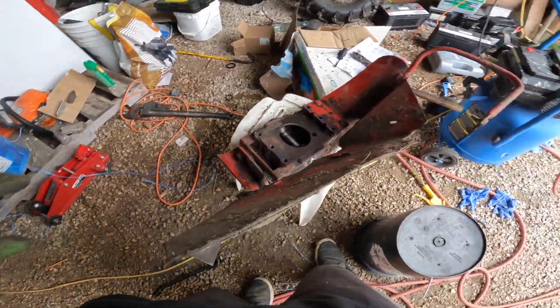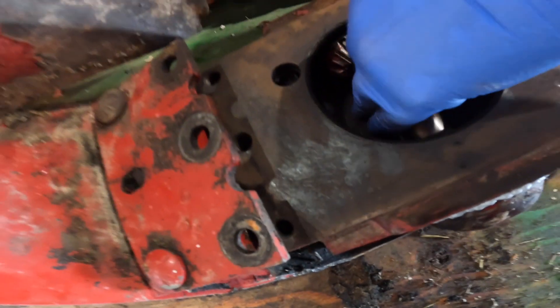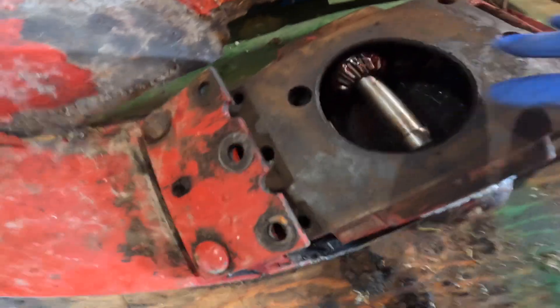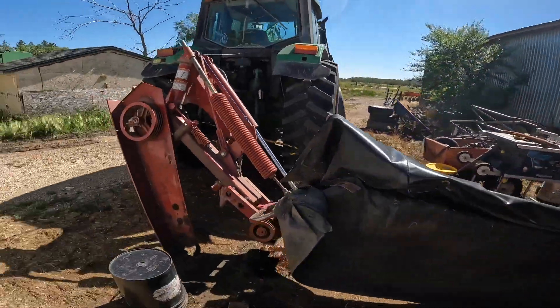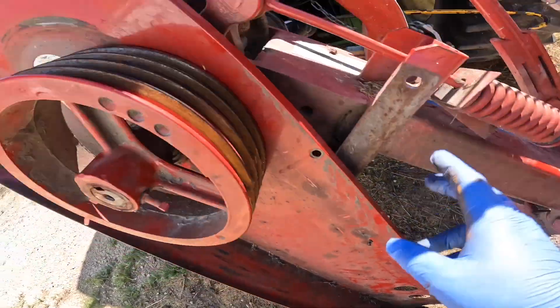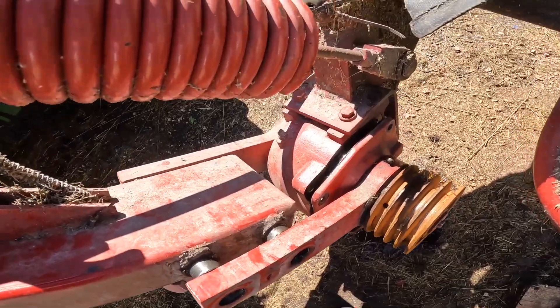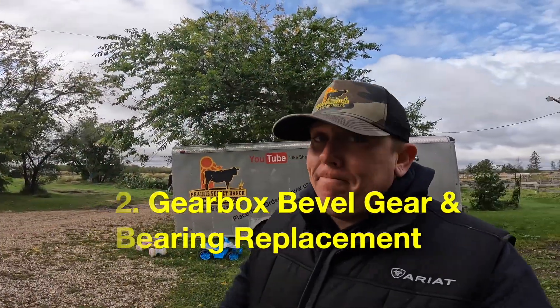Put the dust cap back on, patched up, ready to go, nice and tight. Throw a little bit of grease on those gears and we're good to go. Module underneath the gearbox, fully rebuilt, good to go. Nice seal, got all the snap rings in there. I'm going to fill this with — they call for 10 ounces, I'll probably put 11 to 12 ounces of full synthetic gear oil in there. Got those two major bolts off, took the belt off, slid off half the cover, and now I'm pulling this gear out. Let's rip into this old gearbox — should be fun. That bottom gear is the most important gear on the whole disc mower.